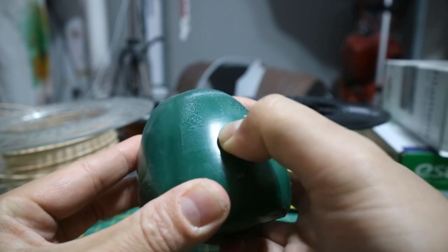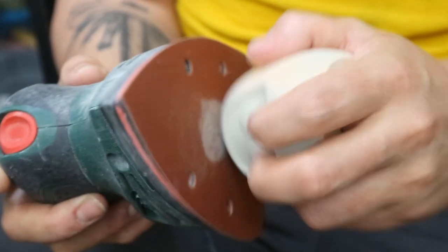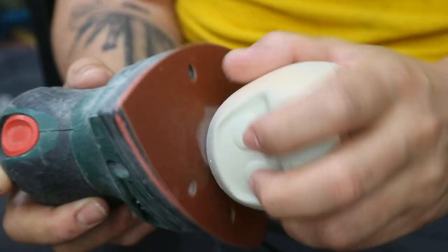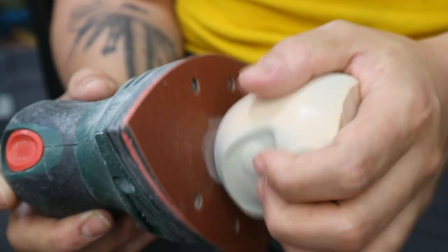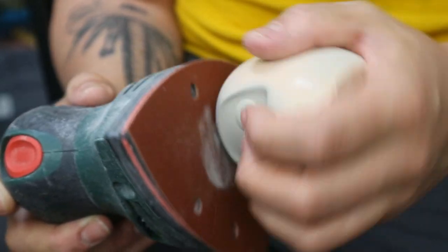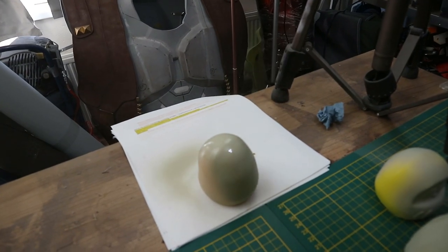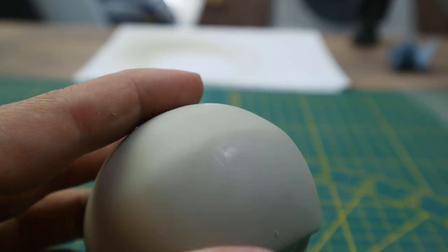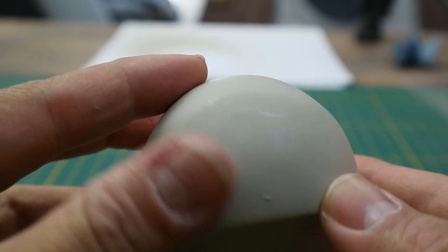I noticed that the PLA got much softer after the acetone heat treatment, even when days have gone by. This makes it in turn much easier to sand. Here is the same Devil Design print with some gnarly stepping on the top — it's been acetone smoothed and sprayed with spray putty. And now with just 30 seconds of light sanding with 180-grit sandpaper, not even pressing hard, just lightly going in circles — it's gone. For better illustration I hit it with one more layer of spray putty, and that's pretty smooth for just that little amount of time.